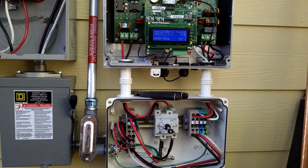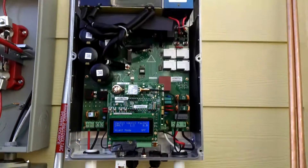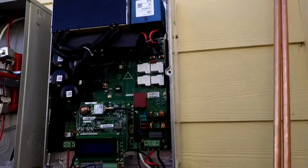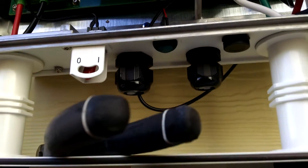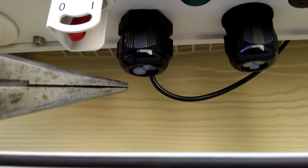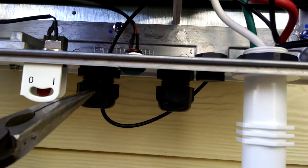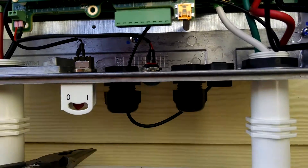Hello, I'd like to go over some best practices for SolarEdge monitoring installation. I've already screwed in the outdoor antenna to the cable and fed it through that cable gland on the left, making sure to use the small hole so it would make a proper seal. Then I tighten this seal tight until the cable does not budge.